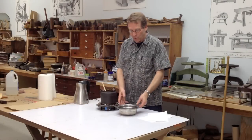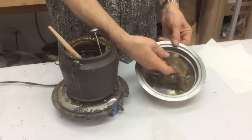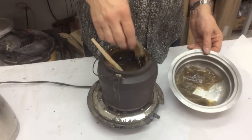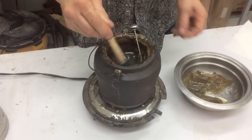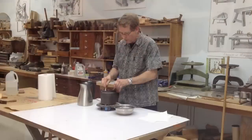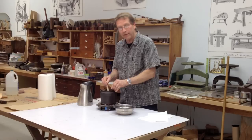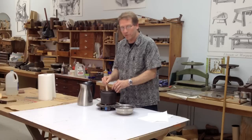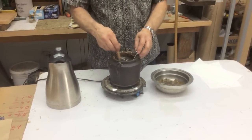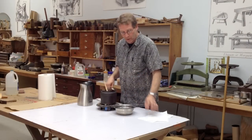The next day the glue has absorbed all of the water and has become gelatin. This is the condition you need so that you can put it back in the glue pot and heat it back up for further use. At the same time you need to add hot water to correct the viscosity. This is all you need to do — take it, save it, remix it, reheat it, back and forth as many times as you want so you never have to waste any glue. That's one of the things I like about animal protein glue — you can save it.